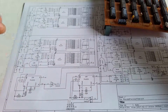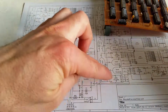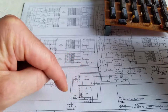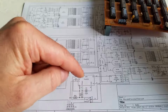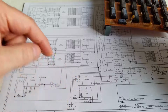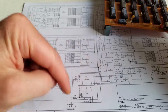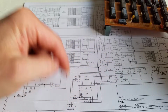And then the other monostable multivibrator just counts the sequencer. So this sequencer starts and stops a count, or inhibits anything extra from happening, which comes back here and puts the multivibrator into a state where it won't re-trigger. This one comes from wherever you want to time, which in the case of the test circuit I was just doing, comes from the output of the clock, and the first rising edge will trigger it to start the count, and the next rising edge, which will be after a full cycle, will trigger it to stop the count and inhibit stuff.